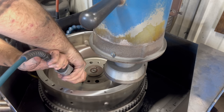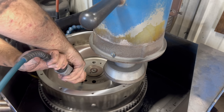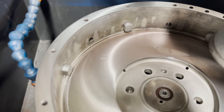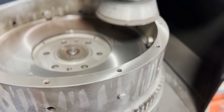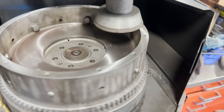I've never been in the installing mechanic's shoes for the install of one of these big flywheels, but as far as I'm aware the chamfer does nothing for the performance of the flywheel. However, taking the sharp edges off goes a long way in keeping your hands safe and cut free as you're moving this chunk of iron around. As you can see the CBN grinding wheel does a wonderful job and leaves a flat surface with a great surface finish. From here we'll typically run the flywheel through our spray cabinet one more time to ensure that it's perfectly clean for our customer.